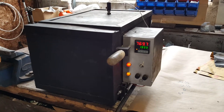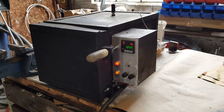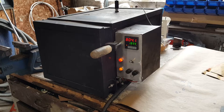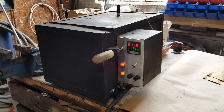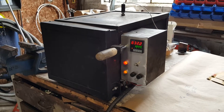This particular oven I've made for 240 volt. It's 3,000 watt. The interior dimensions are 14.5 by 7.5 by 6 inches, which gives a cubic footage of about 0.38 cubic feet. That's about 8,000 watts per cubic foot, which is actually quite a bit.